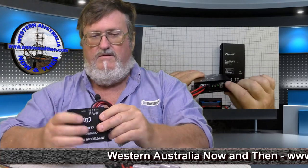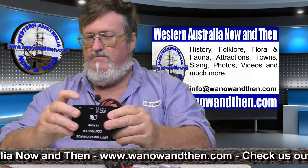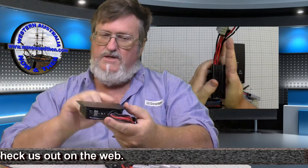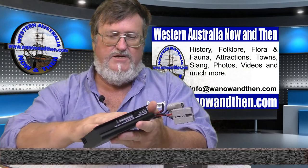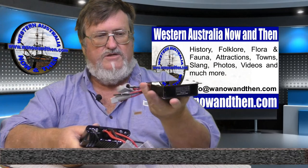You'll be able to see that the eBay unit is a sealed unit — it does have a little LED readout on it, which the larger controller does not have, and it has a little button for various functions and modes. It looks pretty well weather-sealed. But when you look on the back of it, there are no heat sinks at all — not even a gap for heat to escape if mounted against a solid plate. There is very minor heat sinking on the side, but in comparison to the bonafide MPPT with really deep heat sinks and shallow heat sinks on the back to allow airflow, it's a big difference.